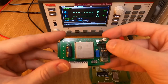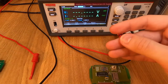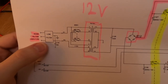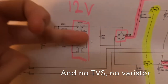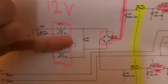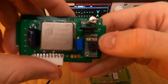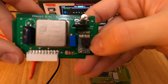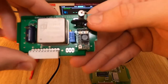Looking at the OCXO datasheet, the adjustment pin range is 0 to 4V. I used a 4V reference with a relatively low temperature coefficient, because the whole purpose of an OCXO is to have a low temperature coefficient for the entire circuit. I added a multi-turn trimmer chosen so that once the board is inside the instrument I can use a screwdriver from the top to finely trim the frequency to exactly 10MHz. I also added a small fuse and a varistor for protection, because the switching module's MLCC caps and switcher IC are sensitive to voltage spikes. These old instruments have little protection, so it's important to connect them to a surge-protected outlet.